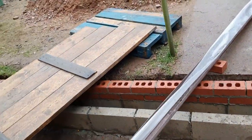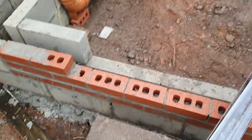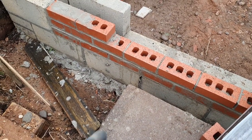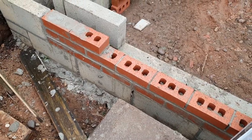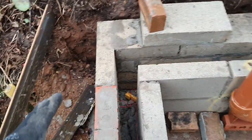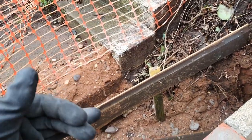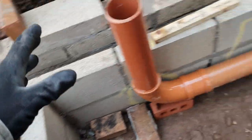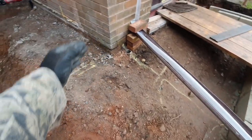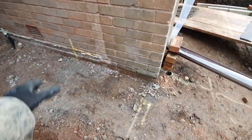On the front we've got through a full bag of sand laying these footings and we've managed to get a bit of the wall started below ground. The engineering brickwork was a bit messy — it was wet yesterday — but it's below ground level so it's not the end of the world. We're also going to build in a utility cabinet outside for a gas box, built into the wall. On this side we've sprayed out on the floor where we want the door to be, then there's going to be a little wall leading into a walk-in wet room style shower tray area.